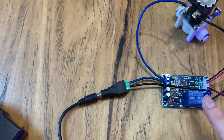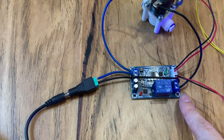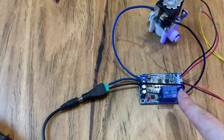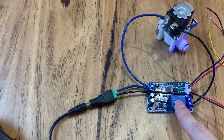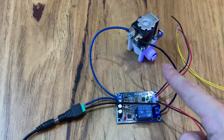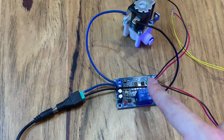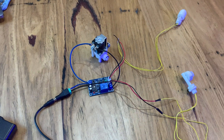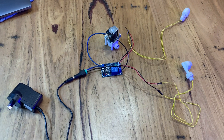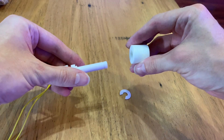To wire it up it's extremely simple. The black wire is connected to the relay outputs — this is where the circuit to the solenoid gets opened and closed. The blue side goes directly to the solenoid. The two float switch connectors: the left one is the bottom switch and the right one is the top switch. Wire it up temporarily and test it manually by operating the switches yourself. If it's not functioning as expected you probably need to flip the orientation of the floats — just remove the bottom clip, flip the float the other way, and replace the clip.